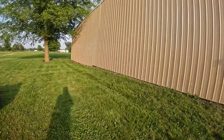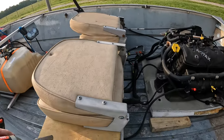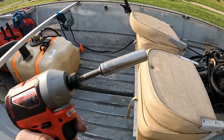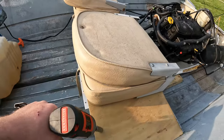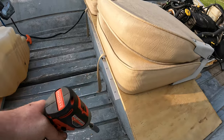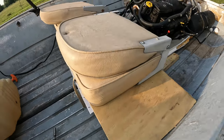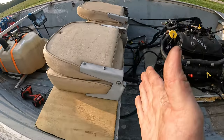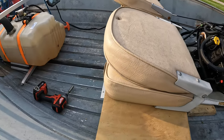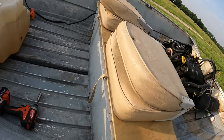We're out here near the shop today getting ready to start working on this boat to get it ready for next weekend, which is Memorial Day. I'm going to take the seats off the wood, get more rivets, re-rivet the piano hinge that broke off, and do away with these seats. I'm going to have some sort of backrest put in, kind of like the other boat, so we'll just have a bottom and a back — we won't be putting all our force into the front of this flimsy aluminum, which got bent pretty good whenever the seat came off.